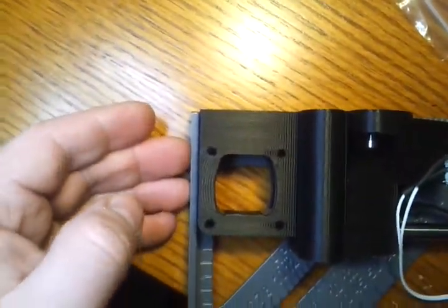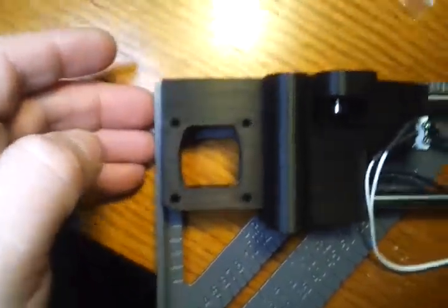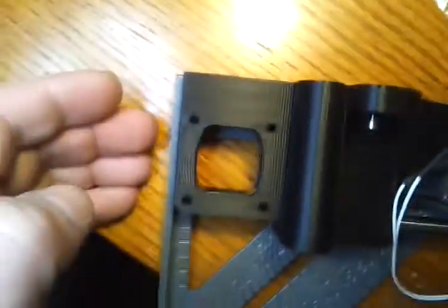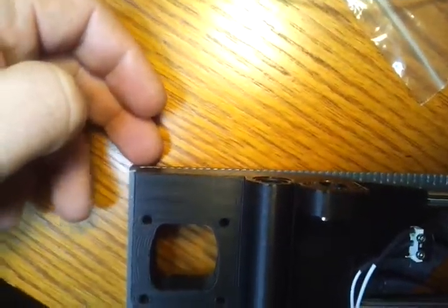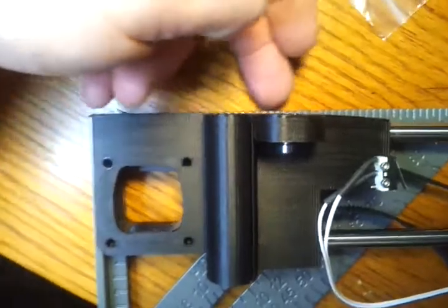Here's the square — as you can see, it's flat along the part. Now if we look at the top of the part, it's clear as day this angles down at that point. Let me push on this again so you can see it's all the way flat, square against that. Look at the top — it's almost touching here. As you get down to where I'm talking about, the part goes down.